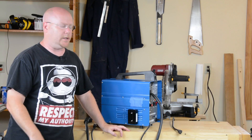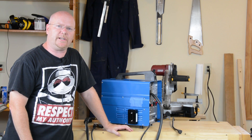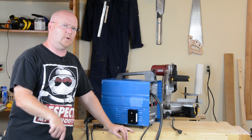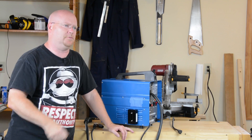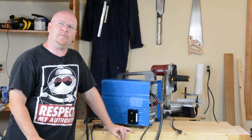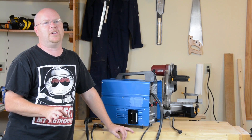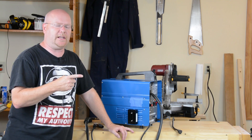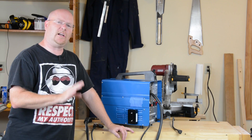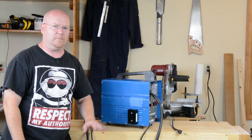Sides are back on. I would like to tell you that there was some trick to this or some magic, but there's not. You just put in a screw, go around the other side, get your pliers, move the wires around, put in another screw, move the wires around. The thing you want to be careful of is bending the terminals all to heck. The wire is so much stiffer than those ring terminals or even the spade lugs on the bridge rectifier. So take your time, put in a couple of screws, make sure everything is where it's supposed to be, and you'll have no problems. The thing will bolt right on.